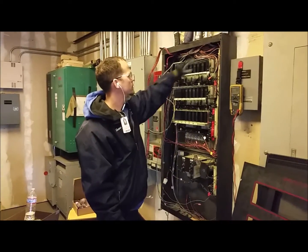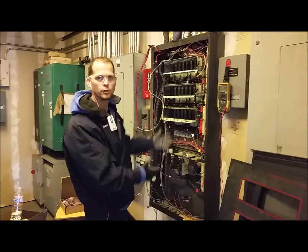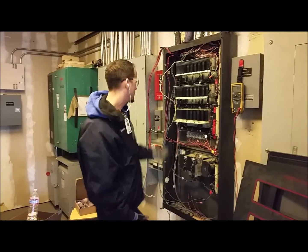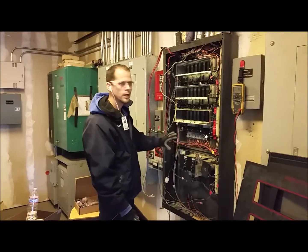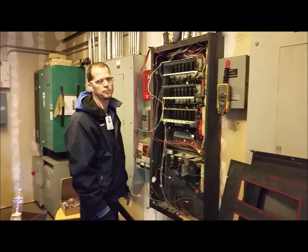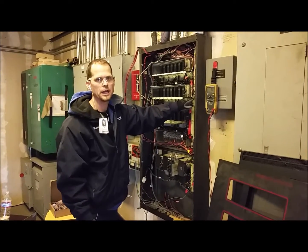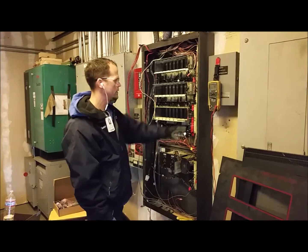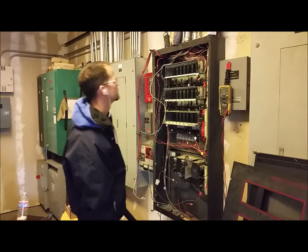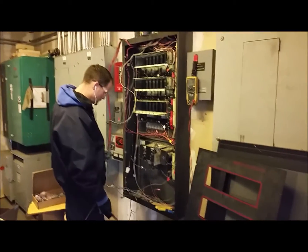A lot of the wiring we're going to run into issues with — the lengths may not reach some of the new zone cards, so you have to deal with that. At that point, maybe installing some terminal cans in there with offset terminals, maybe two of them. Then again, we've got these brackets and I could probably fabricate some of them, reuse these brackets in some of the space. The main thing right now is just to get it undone.